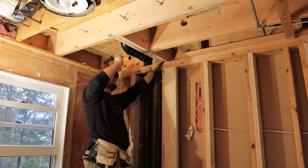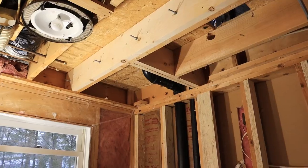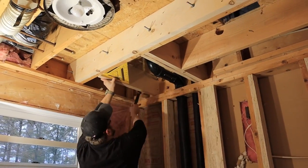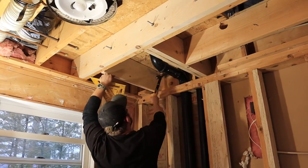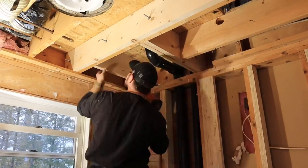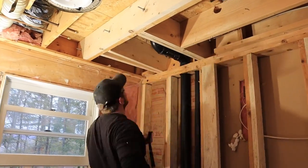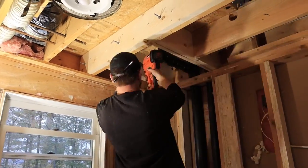Make sure to stick around to see the cool tool I'm using for the joist hangers. The reason I'm boxing this out is because the toilet flange upstairs is going to move about five to six inches to the left, so I want a big open area for the plumber to work in. I'm keeping it at 16 inches — I wouldn't go more than that because it starts getting into that trampoline effect. I doubled this side up and used a palm nailer to get into those really tight areas.